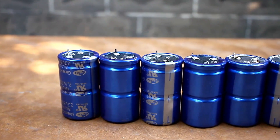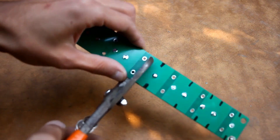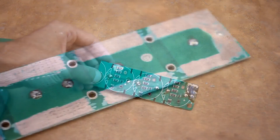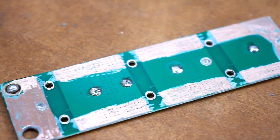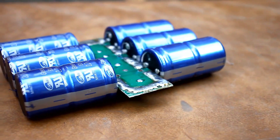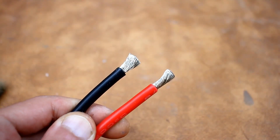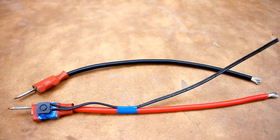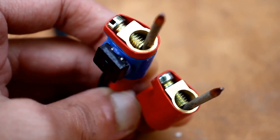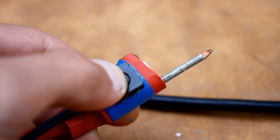The original balancing board is designed for six capacitors connected in series, so I simply cut it in half. Next, I cleaned the solder mask from the power planes, tinned them, and soldered the capacitors on the sides — it looks unusual but beautiful. The switchboard was soldered onto this entire structure. The power wires used are multi-stranded 8AWG in heat-resistant silicone insulation, with a length of 20 cm each. The terminals are brass from a hardware store. The electrodes are made from copper wire with a diameter of 3 mm. The start button is connected to one of the terminals and is located right under the thumb.